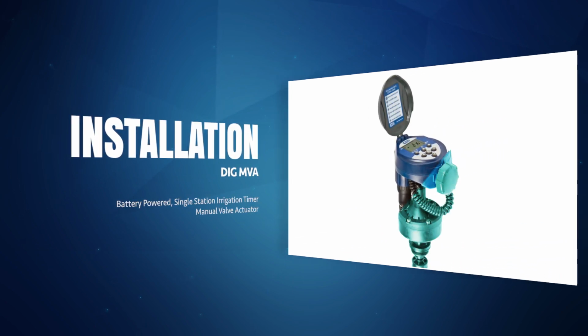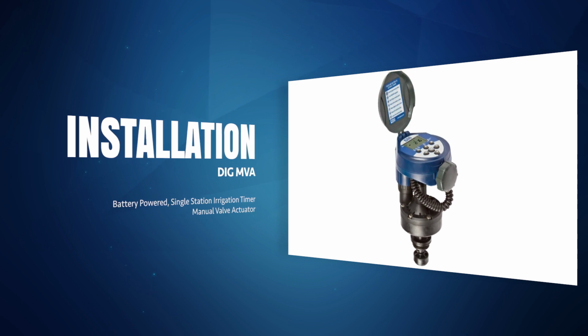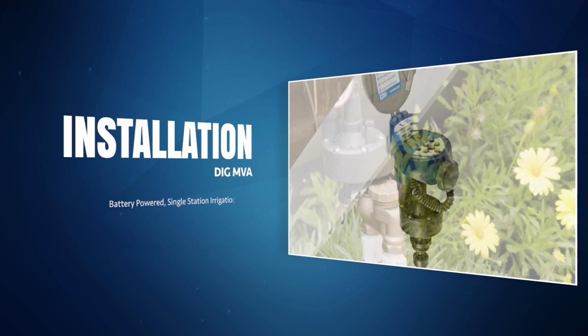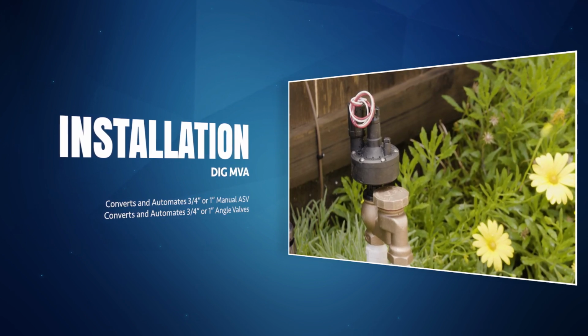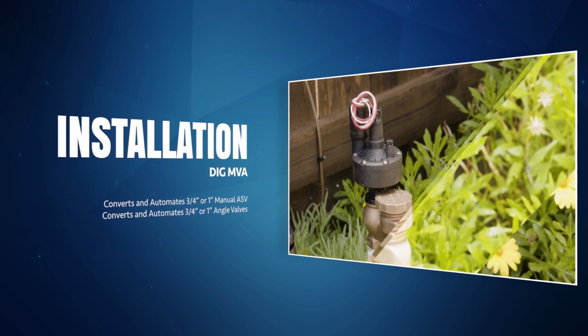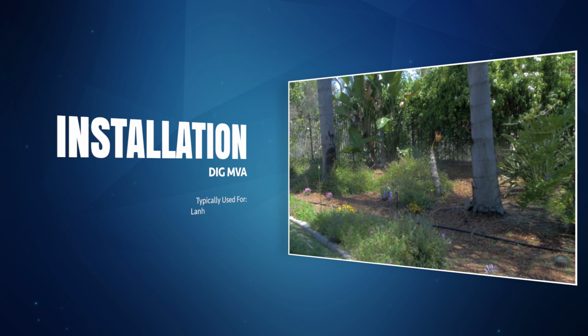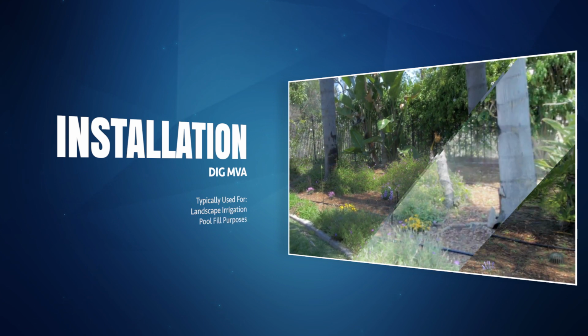Today's video will cover the installation of the DIG MVA, a battery-powered single-station irrigation timer with a manual valve actuator. The DIG MVA is designed to convert and automate 3/4 inch or 1 inch manual anti-siphon valves or angle valves. These are typically used for landscape irrigation or for pool fill purposes.